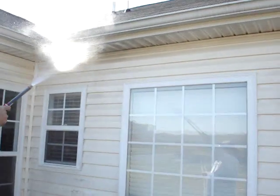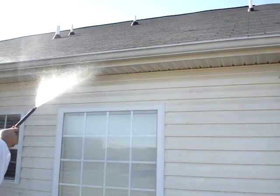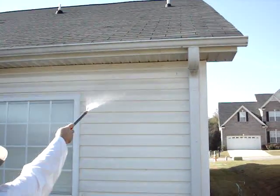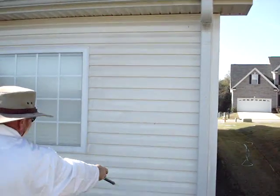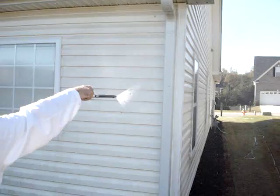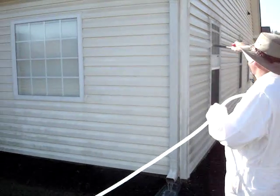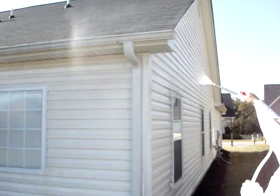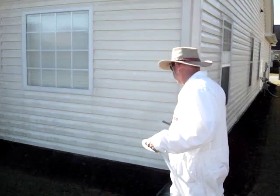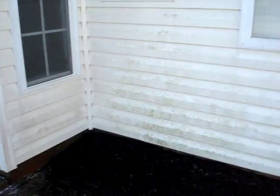And that bloom will come open, and then it'll get exposed to the chemicals and the bleach and all that stuff that's in the chemicals. But initially, when you hit it, it turns real black. The gloeocapsa magma turns real black because the chemical in there is actually forcing the bloom open. Come back over here. See how we're doing on this surface?